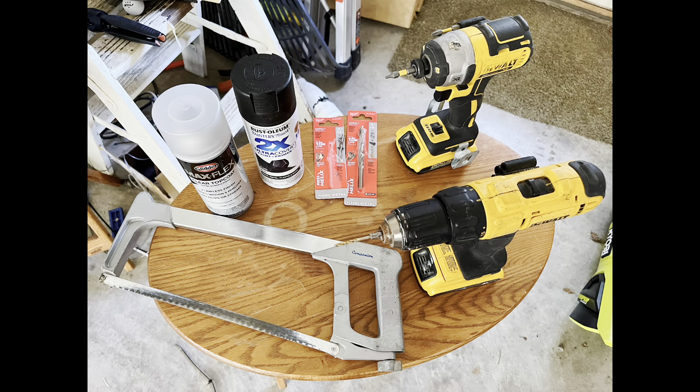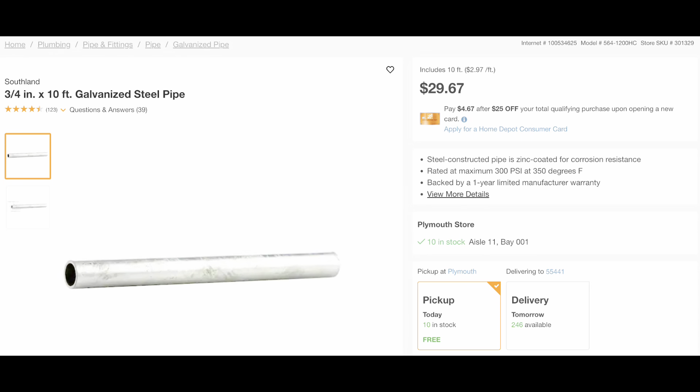I'm going to go through the materials you're going to need — I'll also post these in the description so you can reference back to it. You're going to need a hacksaw to help cut the pole, and metal drill bits specifically for hard metal in the size you choose. You'll also need some spray paint and sealant spray for the flower pot to make it more water resistant. For the poles, I used three-quarter inch ten-foot galvanized steel pipe from Home Depot. The pipe has male threaded ends and comes with caps, which I hacked off — that's why you need the hacksaw. You can also buy female adapter extensions to make the pole higher than ten feet.